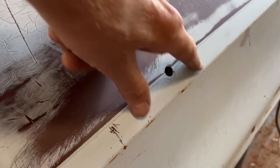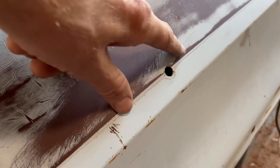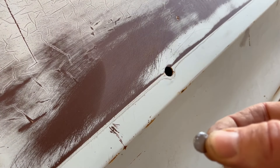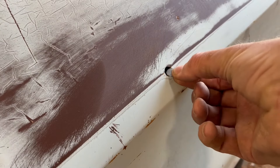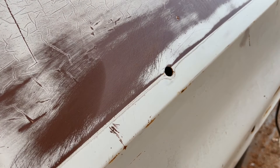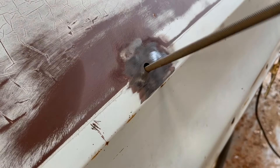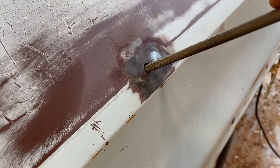We're just going to clear all the paint and everything off for this one area so it'll be nice and clean for the weld. We'll take our newly filed tab with a magnet, put it on there and weld it up. Go ahead and get your round file, ream it out.